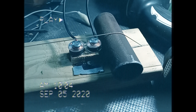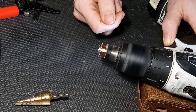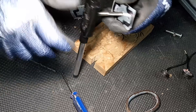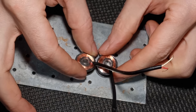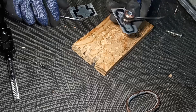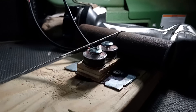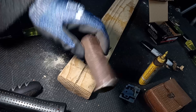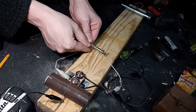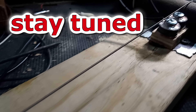In this video we're going to take some sewing machine bobbins and some chopped-up USB cables, do some soldering and winding, some drilling, tapping, poking, gouging, twisting and sliding to make two little single-string guitar pickups. These will be placed on a back plate in both a stacked noiseless single-coil humbucking configuration as requested, and also a normal two-coil humbucking configuration. We'll cobble up a one-string diddly bow, throw the pickups on there, test them on a bench amp, and I'll show and explain the entire process in detail with simple diagrams. If that sounds interesting, stay tuned!